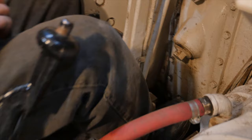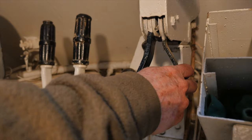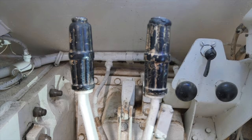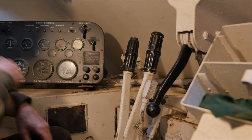To the right I've got an accelerator pedal which operates both engines at the same time. I've got the fuel shutoff lever, which has to be operated forward before you'll get any fuel to start the engines. This is a hand throttle lock, so we can bring the speed of the engines up and lock it at a certain RPM to operate the power traverse if the tank is not actually moving. Up in here there are two knobs and a lever — what are called the cold start knobs — which will actually start a fire within what's called the airbox of the engine and preheat the engines for winter starting. And the two main levers are for slowing down or stopping the tracks — pull one alone and it'll slow or stop that track to do a turn. And just in case we need to, we have a horn.